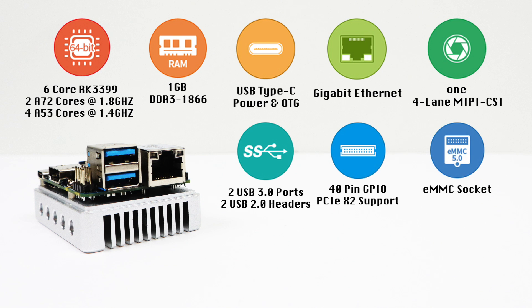Friendly Arm has been adding PCIe X2 support through the GPIO on most of their new boards. With the correct adapter, you can add external SSDs and other PCIe peripherals. There's a proprietary eMMC socket, and as mentioned, Android requires the eMMC module. Full-size HDMI 2.0 port that will do 4K 60Hz — that doesn't mean every codec will do 4K 60fps, but the CPU is capable of handling some formats at that level.